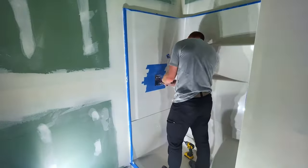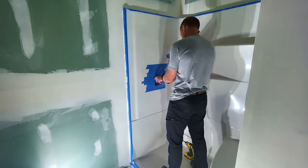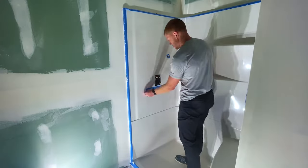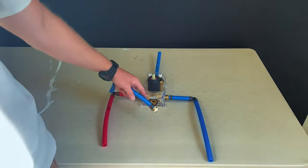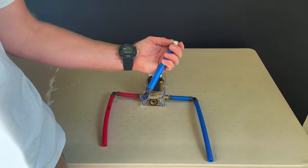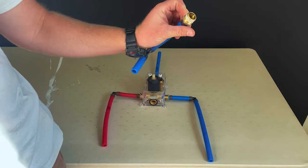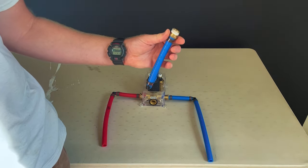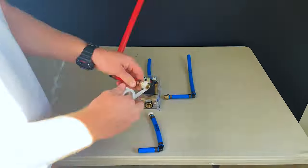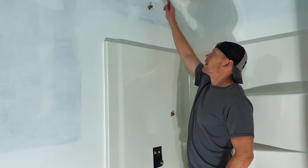Went back to the front side, pulled the valve cover off — you do need a skinny screwdriver for this. Re-watching my videos I think the issues were mostly self-inflicted. Pulled the valve out of the wall; it was leaking at the fittings. I don't know if the fittings are a little out of tolerance or the valve itself, so I added some Teflon tape and piped it up on top of it. Turns out that fixed the problem — no more issues.